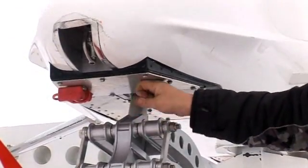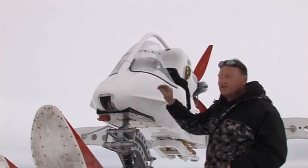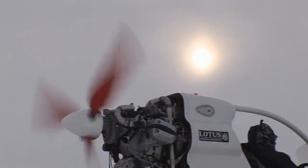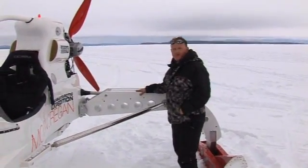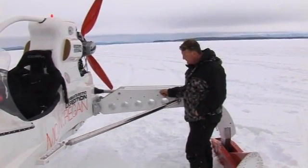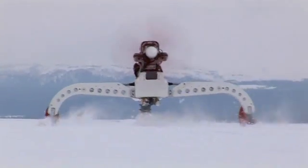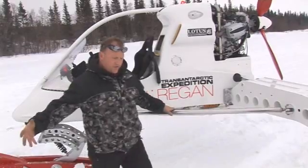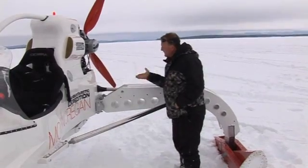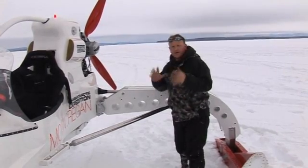The armour plating underneath is aluminium, riveted and bonded. Any cracking and you'll lose components straight into the prop and get a prop strike. The two side arms take a horrendous amount of load — they're also aluminium, welded, heat treated, and x-rayed; about as flawless as you can get. As objects hit the front of the ski, the load is transmitted through the suspension — the push rod goes in and acts against a spring and dampener, same as the front.